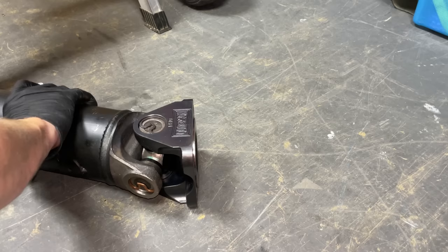But we can't fit it yet because we're still waiting on bolts. So these bolts here, they're only temporary. I've still got to order some proper ones. But anyway, here you can see the ball switch. So we're in neutral and it's pushing that down so that it makes the circuit so that you can start the engine.